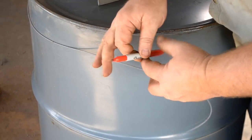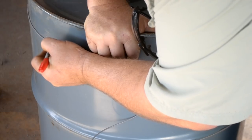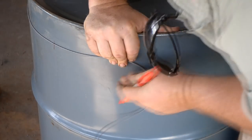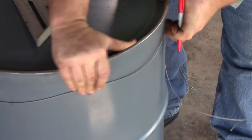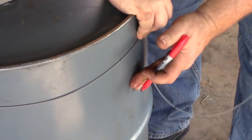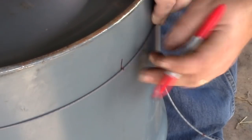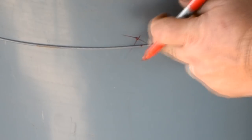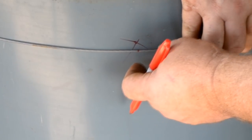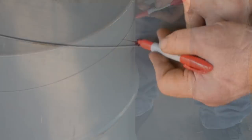That's going to put us pretty close. Won't be exact, but close enough. So we know that's where one of our holes is going to go. And I'll spin the barrel. You need somebody to help you do this so it stays steady. There's my mark at my 18 inch interval. And we'll spin it one more time. There's a mark I'd already put on earlier. So we've spun it. This can show you using a metal tape measure was just a fuzz off. Not very much though. We had it pretty close.